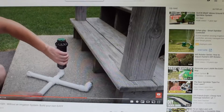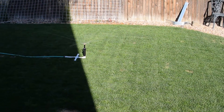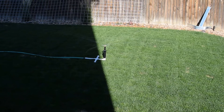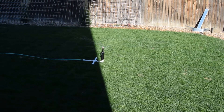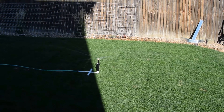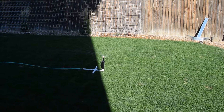Just coincidentally we were watering today. Here's a look at the DIY version — it's the R-Van, goes about 20 feet. I move it three times and turn it down in the narrower section. I think the R-Vans I swap out I'll use to make a few more of these for head-to-head coverage in the backyard since it's been a hot summer. The whole reason you want to do this is to save water — about 30% is what they say. If you spend about 300 bucks normally on water and about 100 bucks on nozzles, you get your payback in a year.